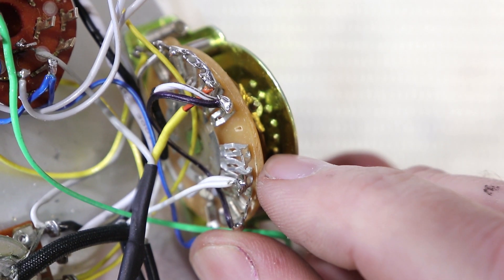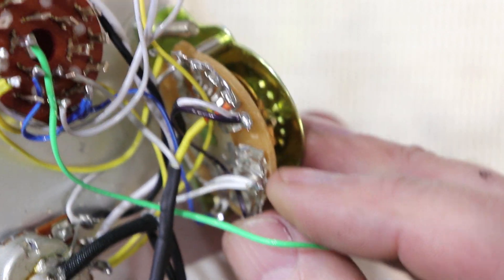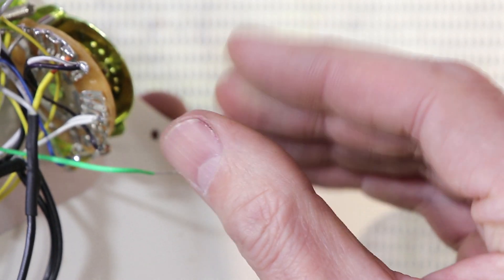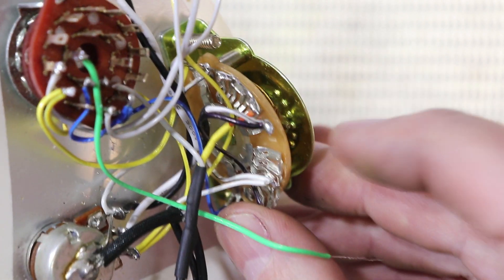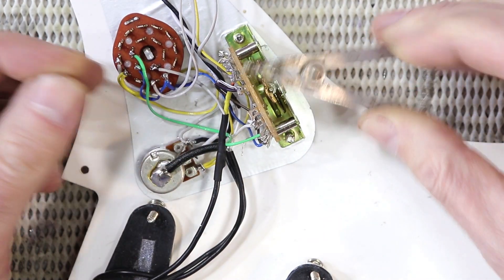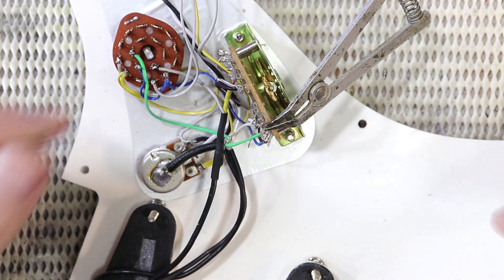The other thing about soldering up to these old-fashioned style switches — these terminals actually have two contacts, almost like a little pair of pliers. They're spring-loaded and squeeze the central sliding contact from both sides. If you're careless with the iron, the solder can actually flow down the terminal and block that contact, or even limit the way it springs back. I don't think there's any coming back from that — even the strongest desoldering pump is not really going to clear that properly, and you've basically ruined a very expensive switch. So I actually twist the wire around the top, then use an aluminium heatsink clip down low on the terminal — just one side will do — and that'll stop the solder from flowing down and potentially ruining the switch.